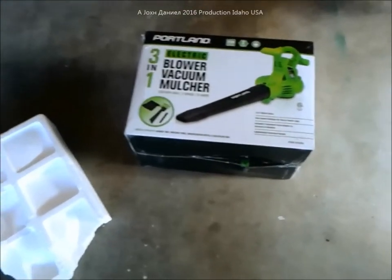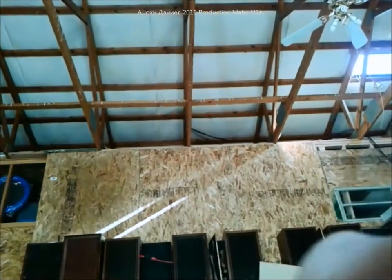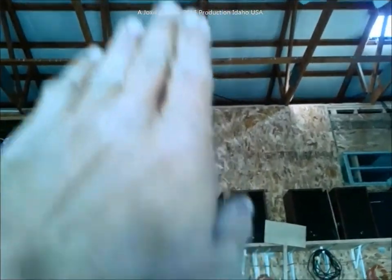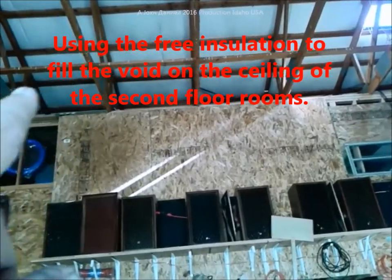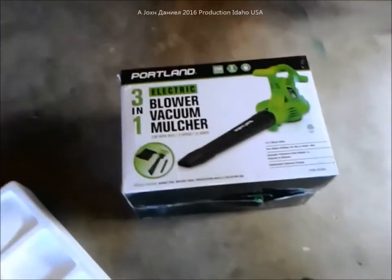I'm on a little adventure here. I'm going to see if I can take this little $30 Harbor Freight item and use it to blow shredded styrofoam up into the spaces above. I could put two-inch styrofoam in these spaces — I've got a whole bunch of two-and-a-half-inch thick pieces — and then blow shredded styrofoam on top, filling the two-by-eight space above. Excellent insulation, and I've got tons of packaging I can use to do this with.